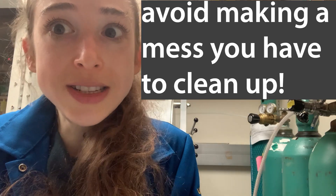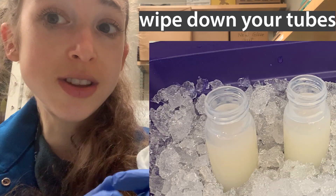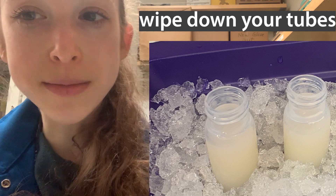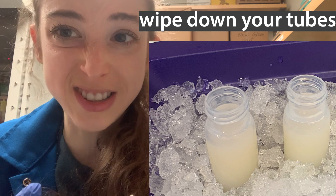Of course, it's better not to get those rotors dirty in the first place. When you're centrifuging, you want to make sure that you're wiping off the tubes. If you have your tubes on ice, you want to wipe off that ice. Even though that's not really grungy, it can still get into the buckets, and then the buckets get wet, and then they can grow mold and all this gross stuff.